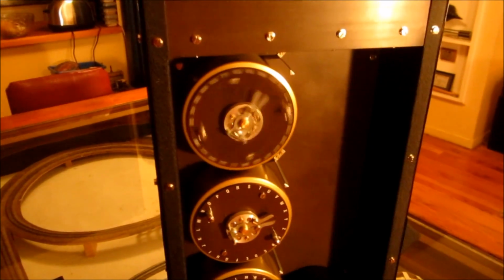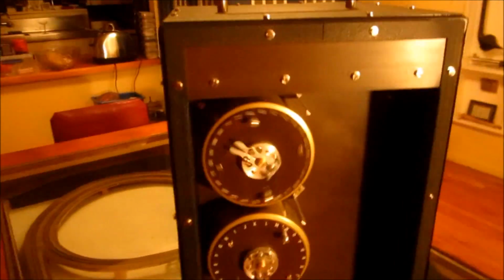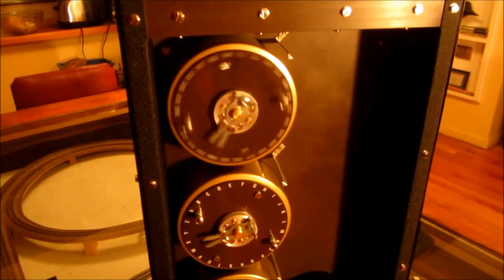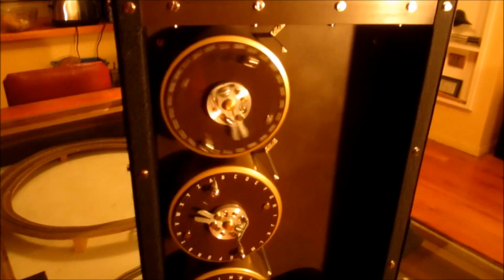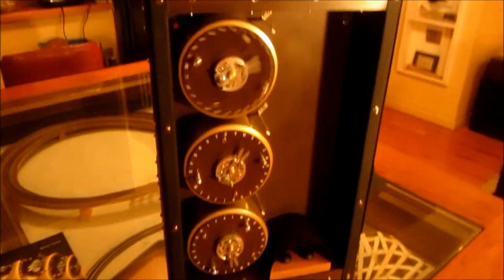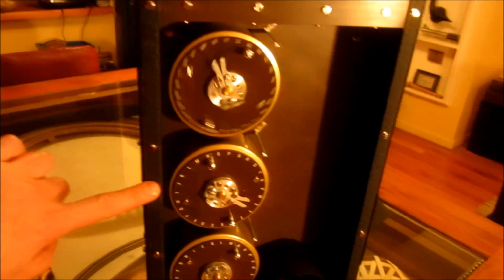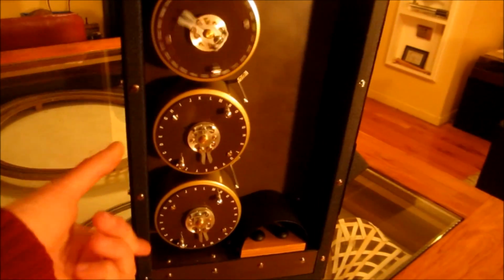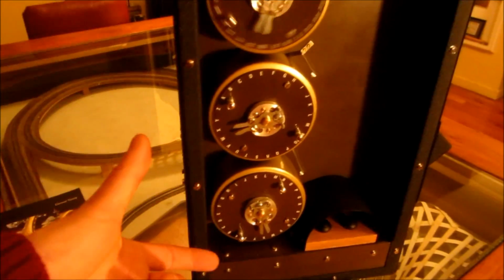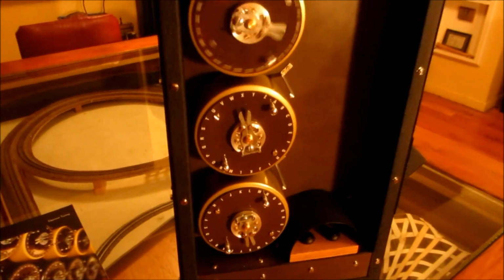Now it took quite a bit of cunning code to be able to move the drums accurately 26 positions, because 26 doesn't divide into 400 very well. So there's quite a bit of fiddling around to get that to work. And the other tricky thing is to get the 3 drums to move in sequence. To do that, instead of driving all 3 drums individually, effectively I have one set of drive signals, and they're going to this top drum all the time. Then at the appropriate times, through a sort of latching buffer, I switch the same drive signals to the 2nd and the 3rd motors when appropriate. So everything moves in sync, because it's very important the whole thing keeps in synchronization really well over the course of a run. And a whole run can take about 20 minutes.